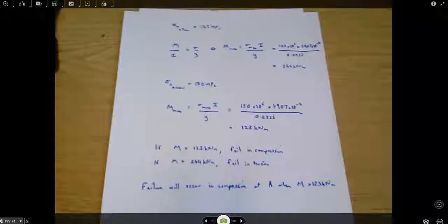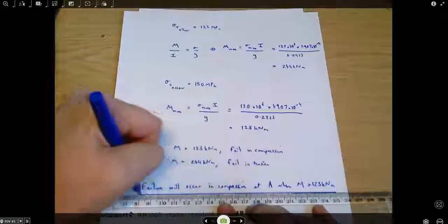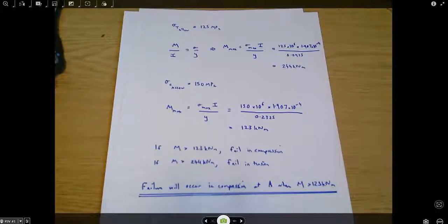So that's how you evaluate bending in girders with T-sections. For I-sections it's slightly easier due to symmetry. You could also have box sections to evaluate, but these are the core principles: find the second moment of area, then use it to perform bending moment calculations.